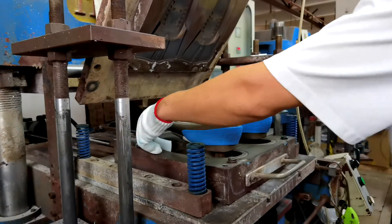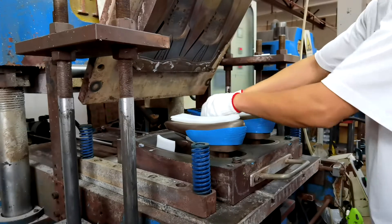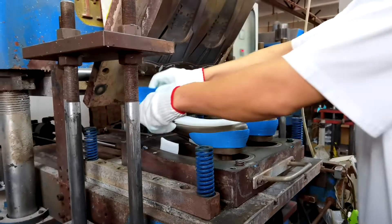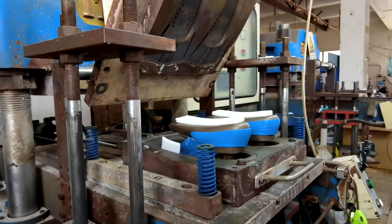Colored fins require a light colored rubber while black fins use darker mixers. These combine the raw rubber with chemicals that vary the color and consistency. A rubber compression mold presses the rubber blocks into fins with a cycle time of 400 seconds.